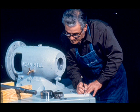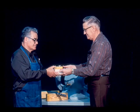Once you have removed the bearings, record the bearing identification on a piece of paper. You'll need this identification when you order replacement bearings. The workman is also ordering a new lock nut and lock washer in this particular case, since the old ones were somewhat battered.